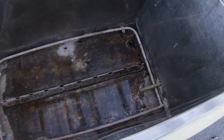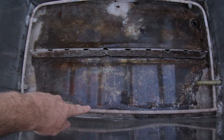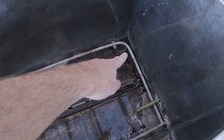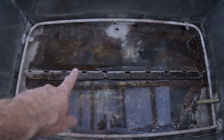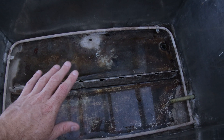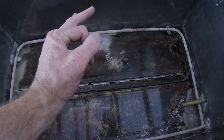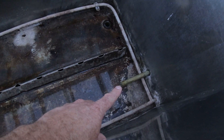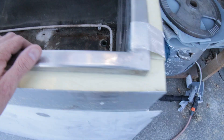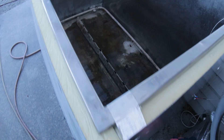If we lift this up you can see inside the tank. The steam comes in down here and gets pushed around this pipe which runs around the outside — it's got heaps of little holes drilled through it to direct the steam in. This big ridge down the middle helps hold up the false floor, which has heaps of little holes cut through it. There's the drain out there, and this pipe coming in here was actually a temperature gauge which sticks out over there.